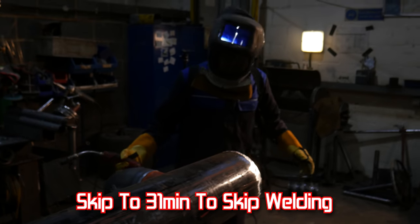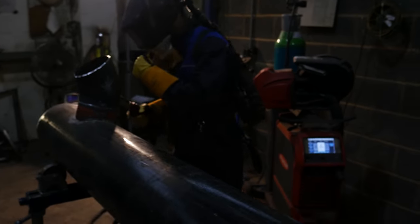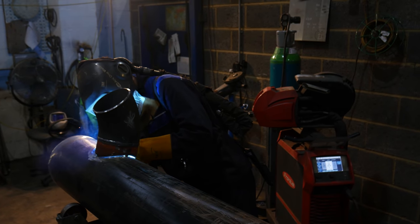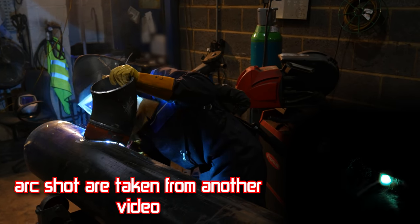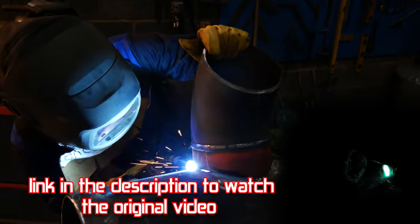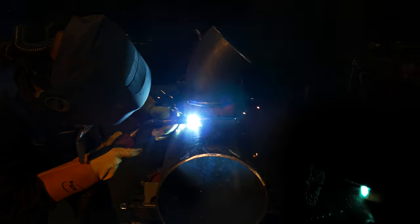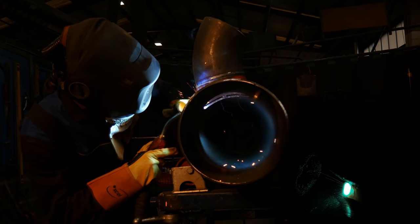I'm going to start off by welding this bigger gap. The first side I prepped had a tiny little gap on it, so hopefully welding here should open up the other side. I'm going to do a mixture of stoving the welds and a whole bunch of different techniques to get the root in. I'm making sure to push the arc all the way through — I want to get penetration at the very back of the weld. That's why I stove it sometimes.